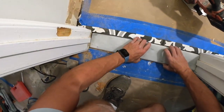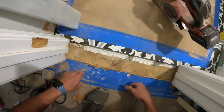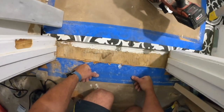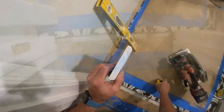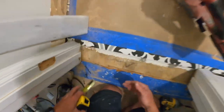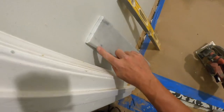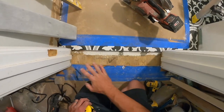Next step is putting in mortar. I fill this up with mortar, and I also add some screws just to hold it up a little bit. Now, people will say 'you put mortar on plywood?' — a modified mortar can actually be put on plywood no problem. Dampen it first. As you can see, this is modified mortar and it's not moving whatsoever. We have five-eighths of an inch here and about one inch to the tile, then three-quarters. I'm going to put it on a slight slope so it's level with both floors — you don't want a step. I split the difference so it's even — it just looks so much better.